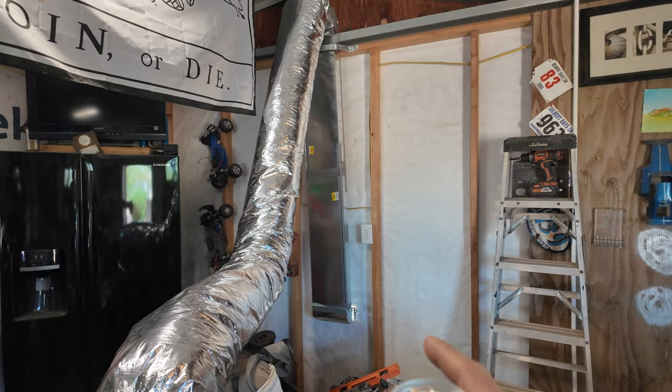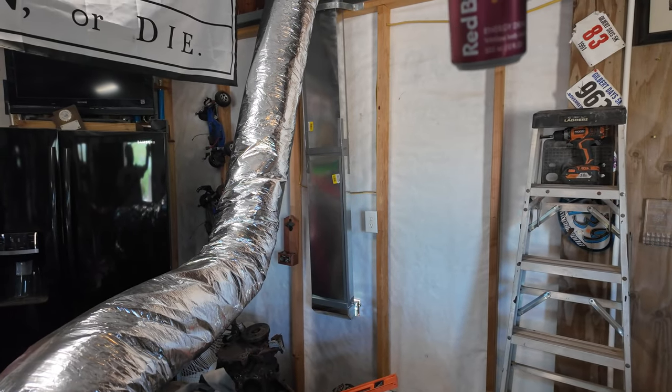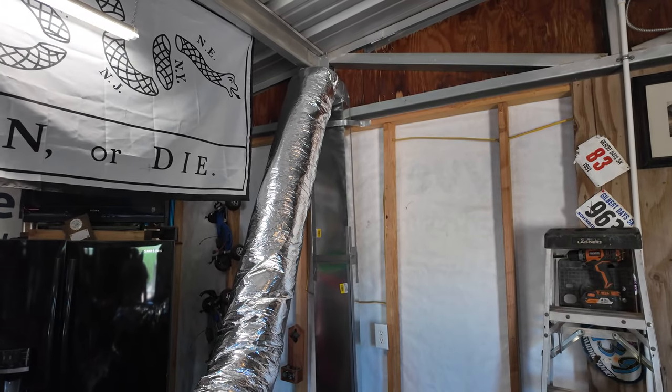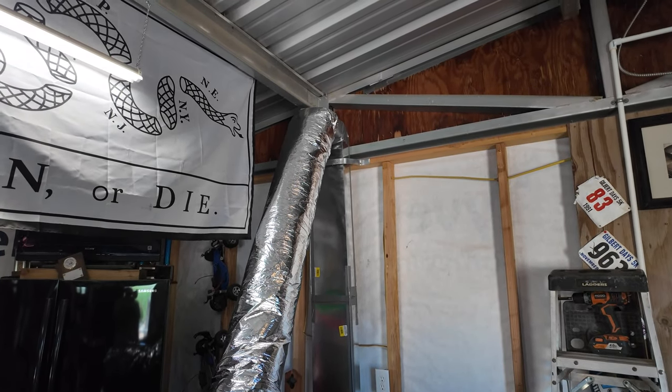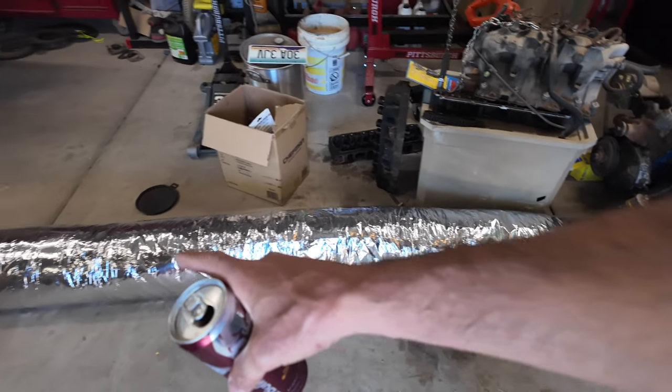Welcome back. It's the next morning. It was getting late. I was getting tired, hungry, so I called it quits. But what we ended up getting done before I rolled out was got the vent in, put the hole in the wall, put it in. I got to move it over just a little bit. It's kind of not centered up at the top there. But now we just got to hang this duct and then put the rest of our registers in.